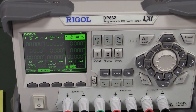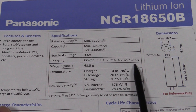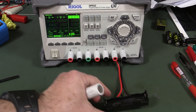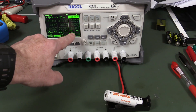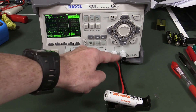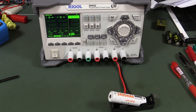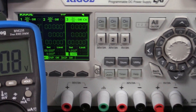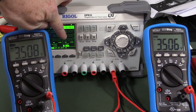Lab power supplies are perfect for this sort of application. The only thing it's not going to do is automatically cut out at the end. It could if you had a fancy programmable supply - which this one is - but most people won't have that. The charging is specified at a maximum of 4 hours, so we can just set a countdown timer for 4 hours and get it to go ping when it's finished. I do happen to have an 18650 battery holder, so we can hook that up. If you set your 4.2 volt limit, the worst that can happen is a slight voltage drop - it can't go over 4.2, so your cell's not going to explode. We've got our 4.2 volts maximum voltage and our 1.7 amps set up.